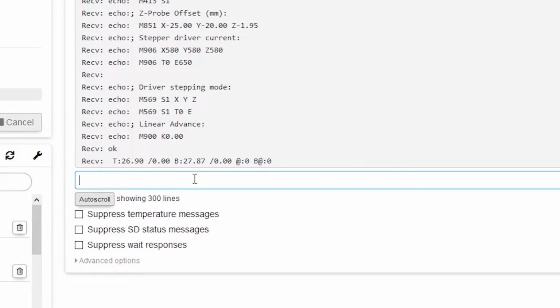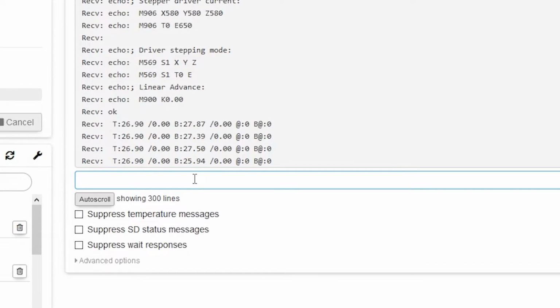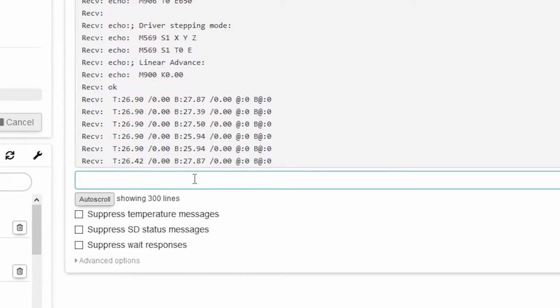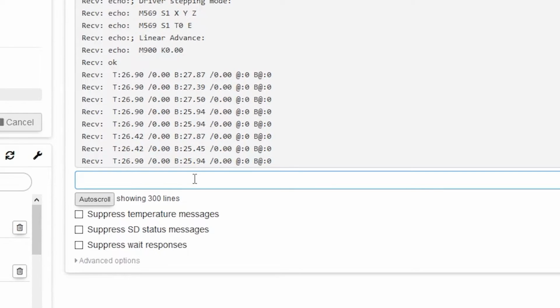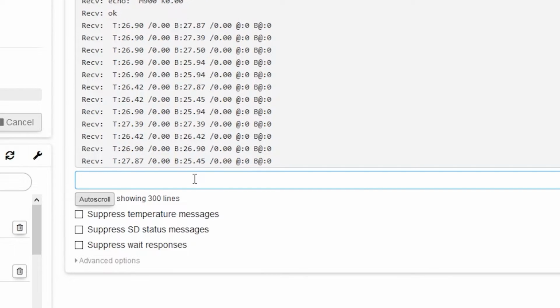And there we go. That's pretty much it for setting your Z offset. Now, as your first time using the BLtouch, it's going to be important that you might have to adjust your Z offset a few times. You may not always get it right the first time, and that could just be because you did some steps out of order, or maybe the bed wasn't as warm as it needed to be when it was measuring. So there are a lot of different factors, but just mess around with the settings.